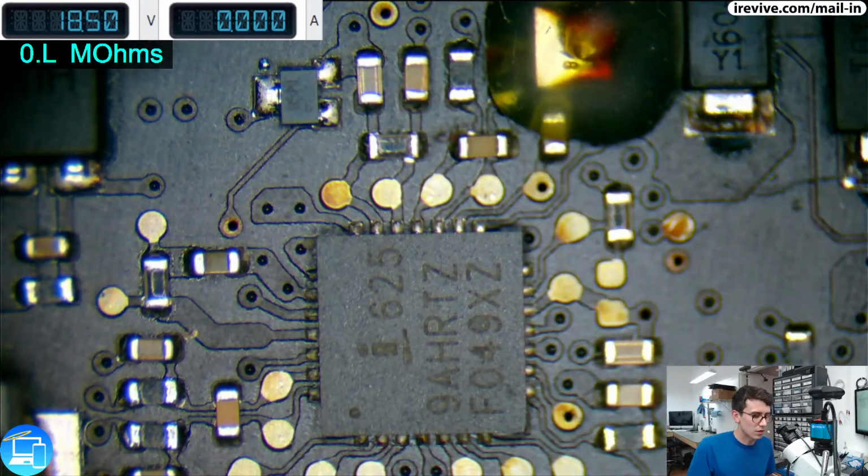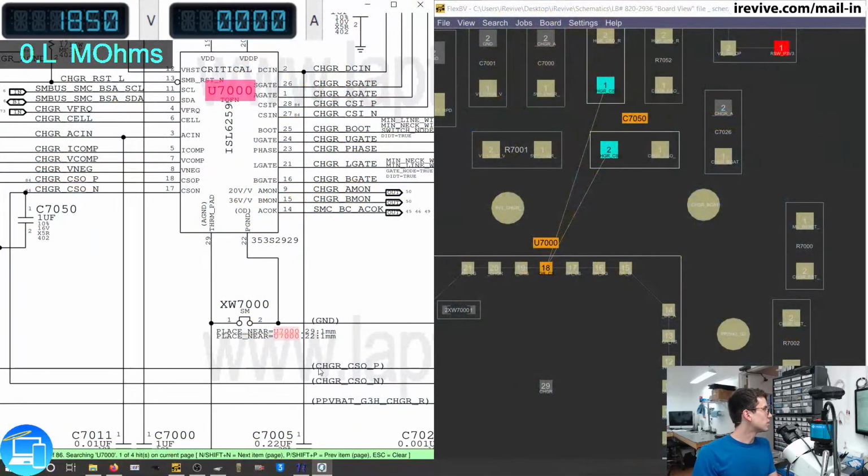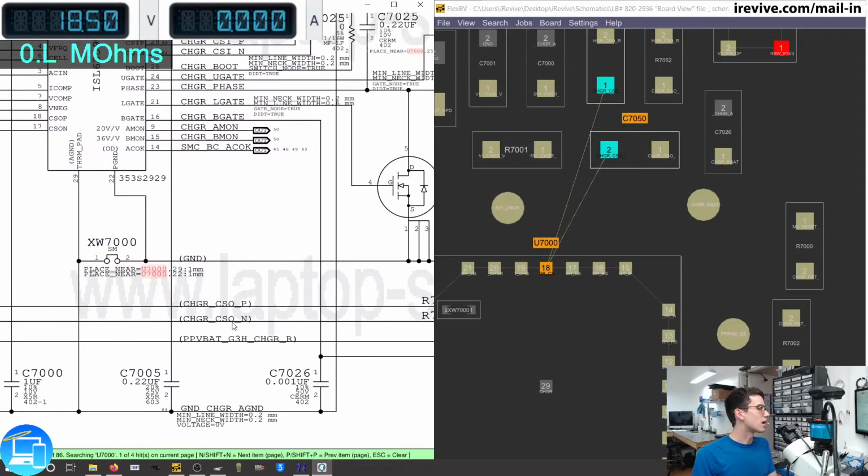So basically what's going on is the computer, this would explain why it sometimes works and sometimes doesn't, because usually the other current sensor I discover is the issue here. But this one near the battery circuit is really what's going on, which could be attributed to the aftermarket battery that's installed. So being that we have a resistance of about 17 ohms, basically the U7000, it's doing its job and cutting off the computer. It feels like that it's sensing too much current and just shutting itself off.